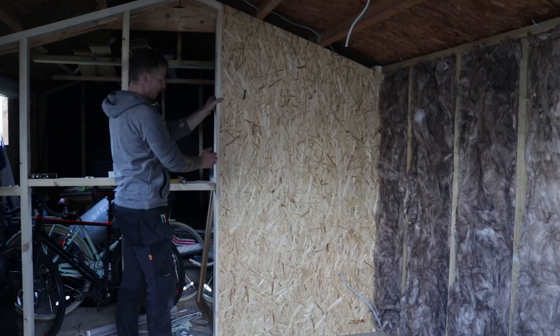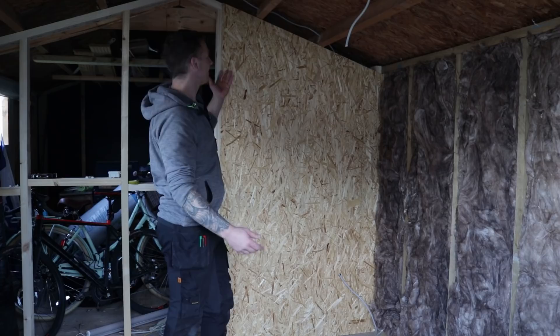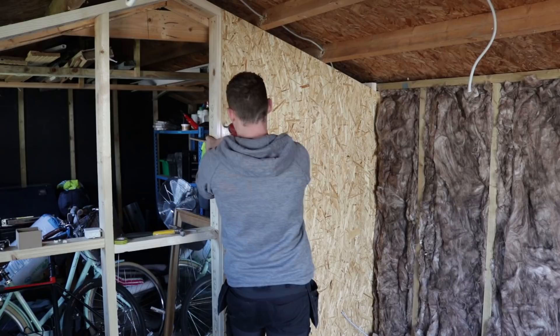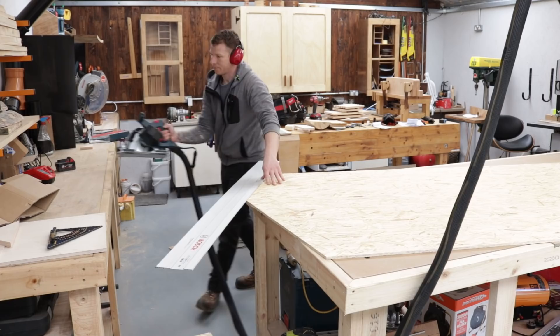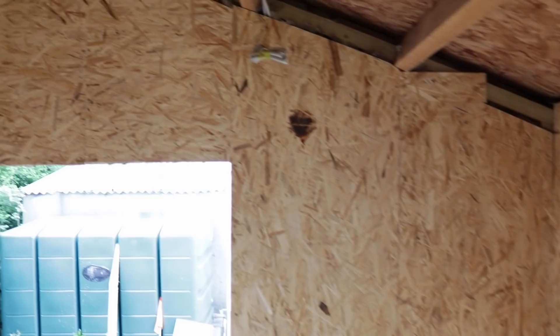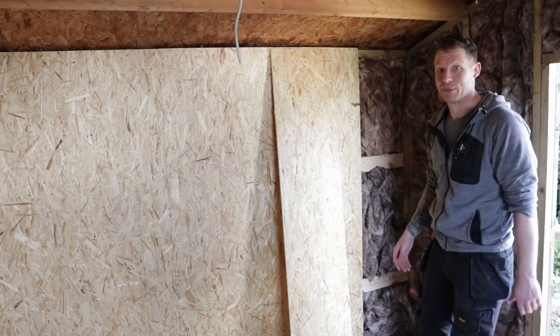There's our first sheet in place. You can see I left spacing for the socket cable to come through, and this will add rigidity to the wall too. The track saw is ideal for this kind of work — it makes it quick and easy. I'm getting all the full-width sheets up first to minimize off-cuts, and I'm adding cross pieces into the walls to support the sheets since the shed wasn't laid out for 8x4. Flying through it with the track saw.